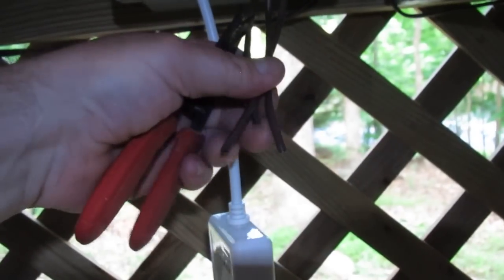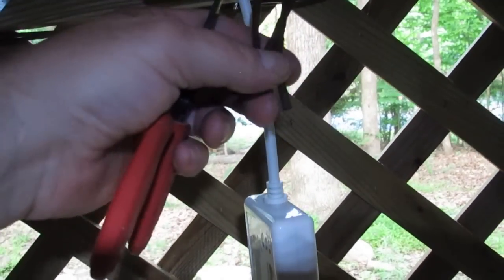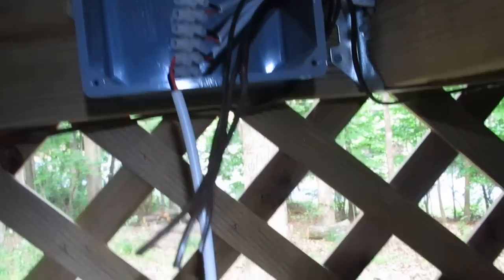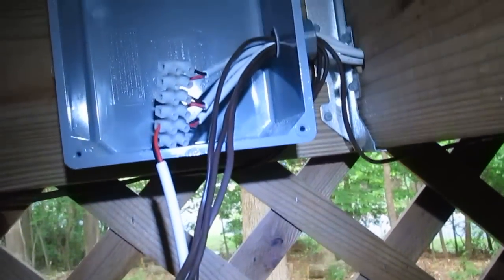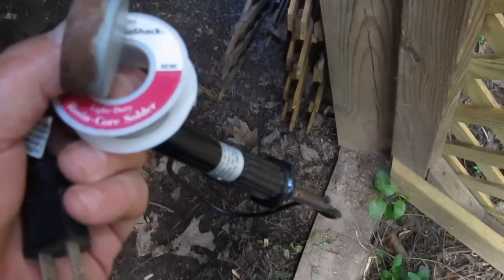My mission at this point is to strip and twist and solder and connect all the wires to the block. The true touch of professionalism — we've been tinning every lead and making sure everything's just right. There's Spitz over there tightening up the last connector block at one of our little weatherproof enclosures. Very soon we will be testing the lights. It's an exciting moment in history.